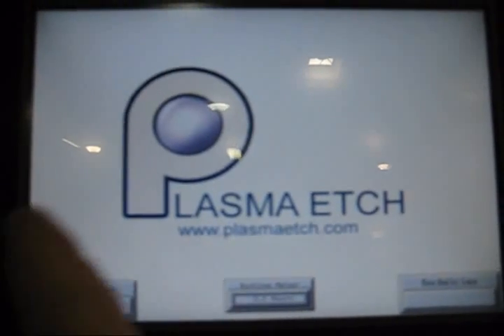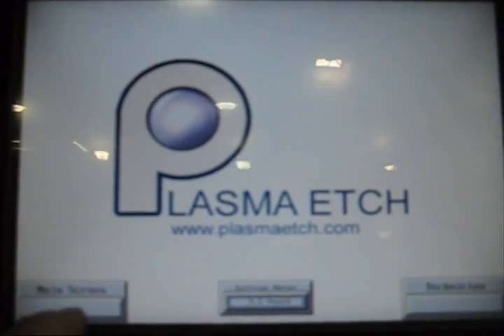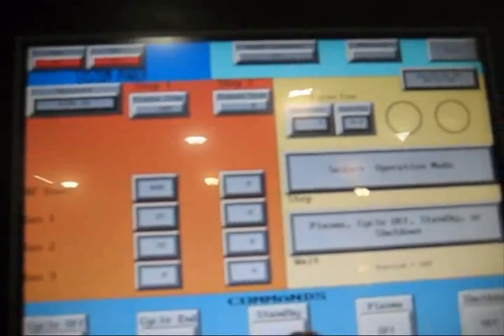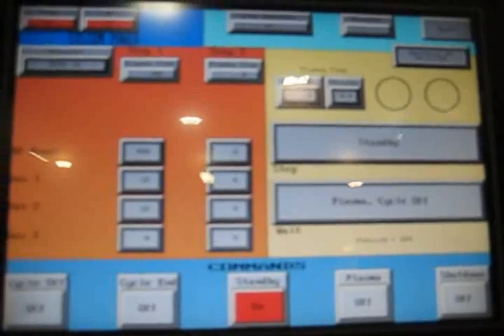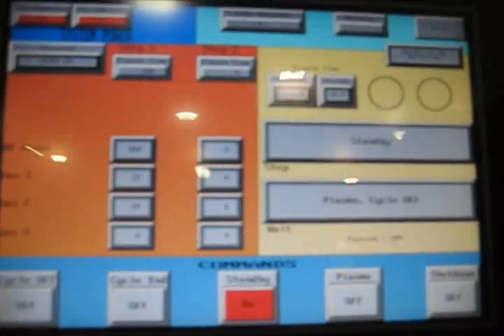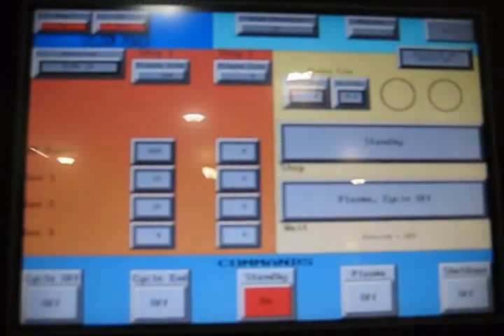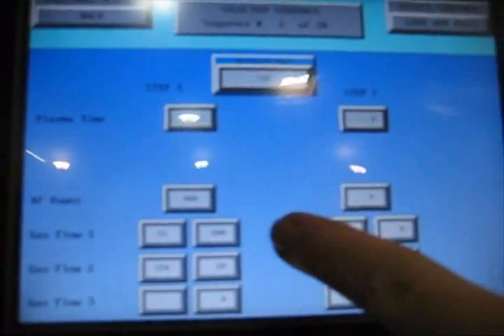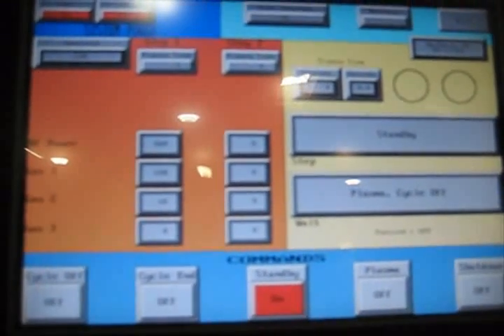We'll exit once more, come out to the main screen, then go to the operation screen — this is what the operator will see when he comes to work. He starts it up, turns on the vacuum pump, turns on the RF generator, puts it in standby mode. This will always start up with the very first process loaded in there. This particular machine is brand new; I have a burn-in process, but I'm going to load the process we just wrote, which is the CDE. We see the 400 watts, 100 cc's, 10 cc's — and we're going to load that. It loads into the main screen.